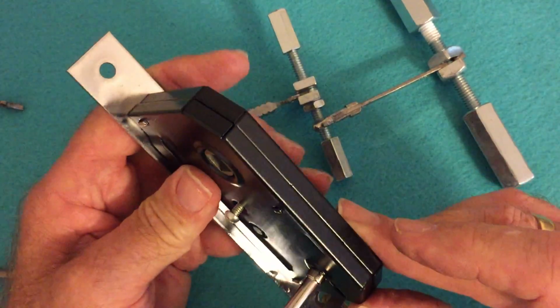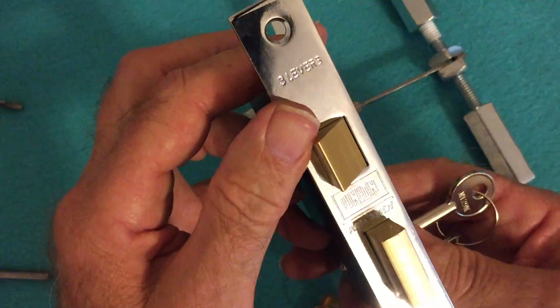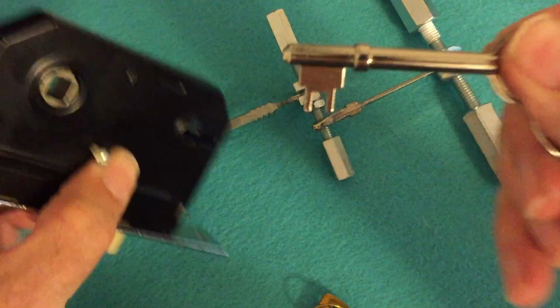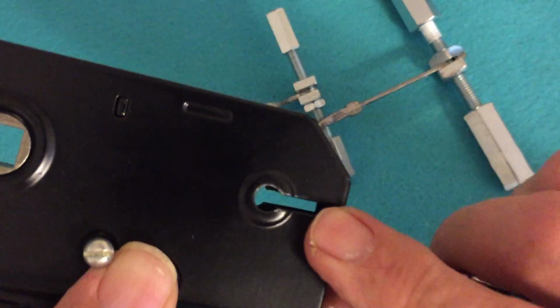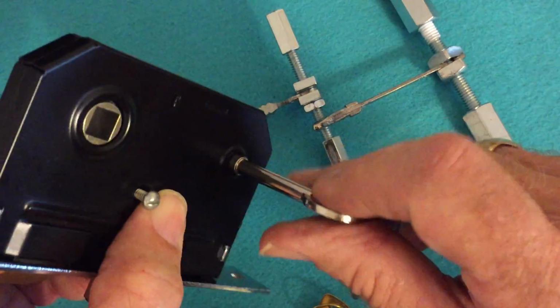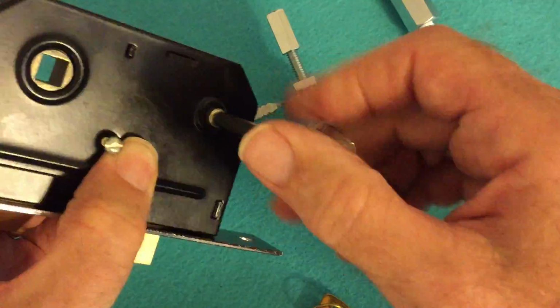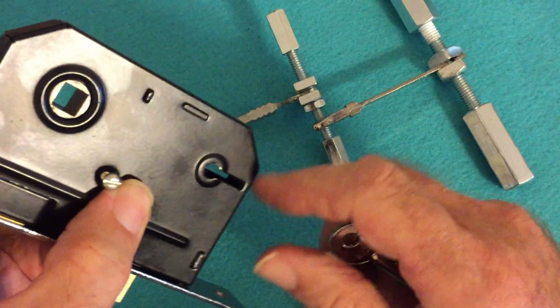And this is another mortise lock. This is a very simple 3 lever lock and has no gates in it. It's a Union Assa Abloy lock, and locks like that. The key has bitting like that, and if you look in here, there's no curtain in it. It's just a plain old keyhole. The key goes in, and this shoulder goes into here, and it can't go any further. So you can turn the lock to lock it or unlock it. And the levers inside just look like the other levers do, but without false gates to it.